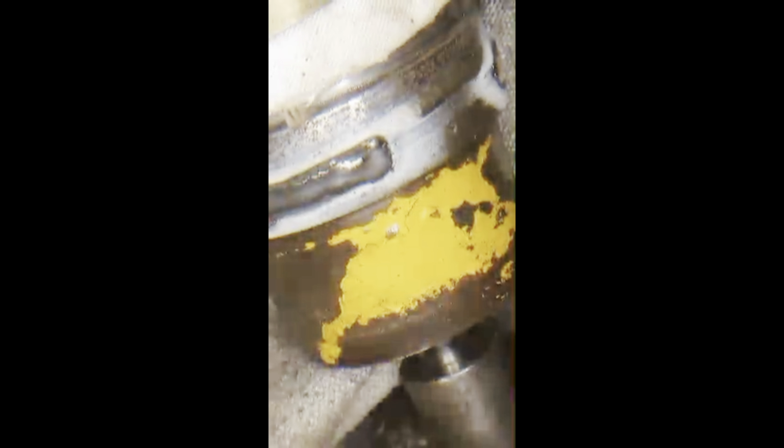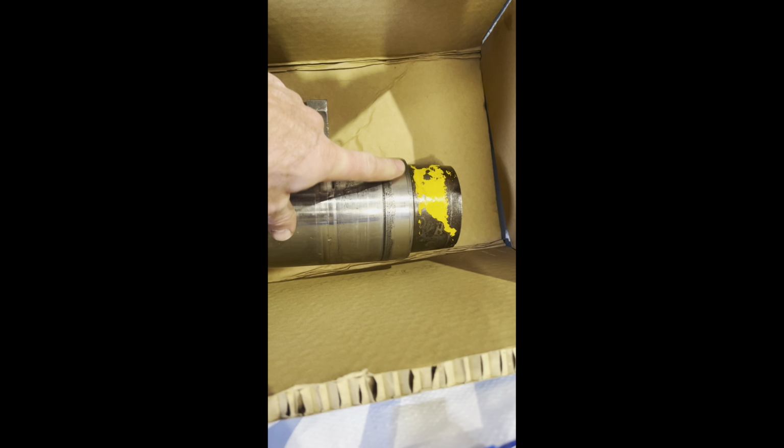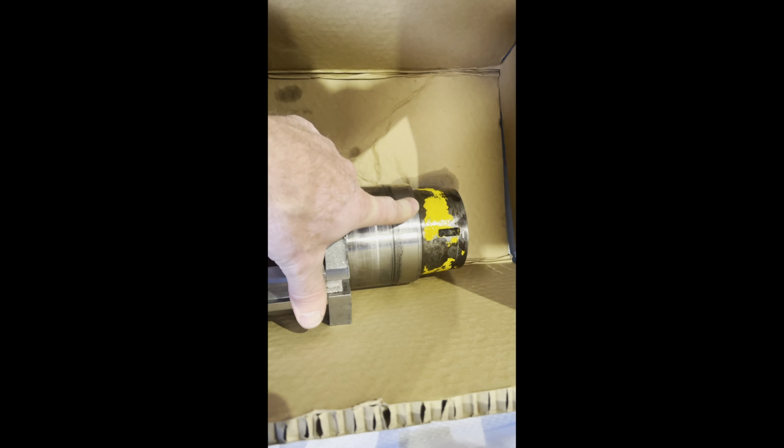We got the shaft back from a friend with the lathe. So he put some welds on here with some special witchcraft welding rod that you can weld, for example, a hydraulic ram. If you nick it, you can weld it and it makes a very nice surface. And then he turned it down in the lathe and polished it. So we are quite confident that that's going to help seal the top lid.